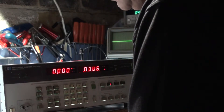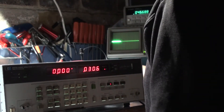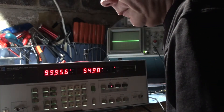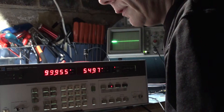Disconnect the AC voltmeter from the high output jack, connected to the low output. Connect the low output to the high input — low output to the high input. I did have it in the wrong port, so it was as it suggested — I did have it on high. So that's connected to the high output, low input. So 100kHz AC voltmeter on the high output, connected low output to high input. Adjust C31 HF balance.